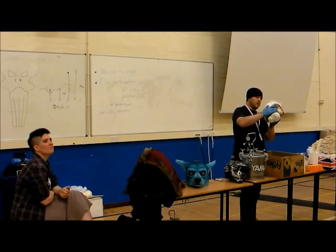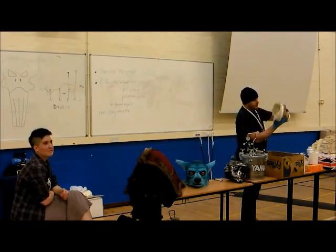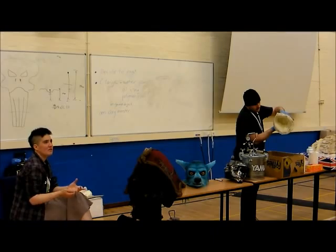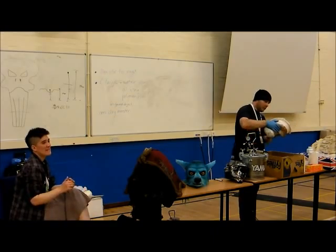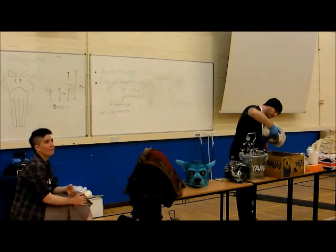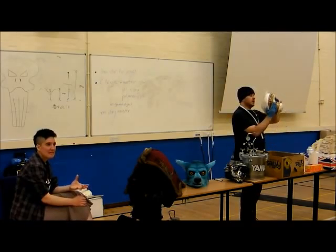How long can you leave it between? Not long. It's best to do it all in one, about 5 minutes. You can't do it in two sessions. It won't stick to itself. It'll stick to itself when it's still called green, when it's still a bit tacky, but it'll stop doing that when it's a plastic. It'll stick a bit, and then it won't.